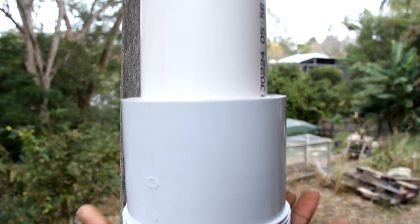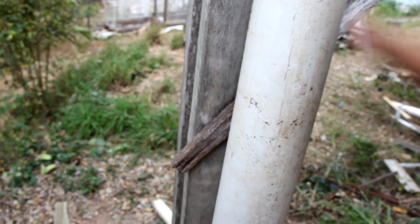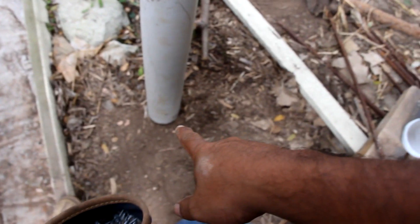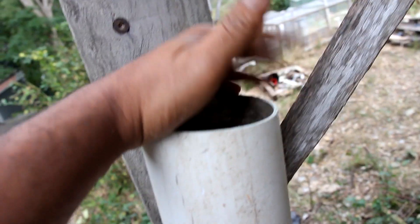We take that sleeve and push it all up. So now we've got the 90mm pipe going into the reducer, and I'll just have to put in this 100mm pipe up into there. One of the bonuses of doing this myself rather than an off-the-shelf kit is that I get to use a 100mm pipe — every metre of 100mm pipe gives me an extra 6 litres of dirty water I can flush away versus a 90mm system. It's just a little bonus that just ensures a lot more of the dirty water gets removed before going to the tank.